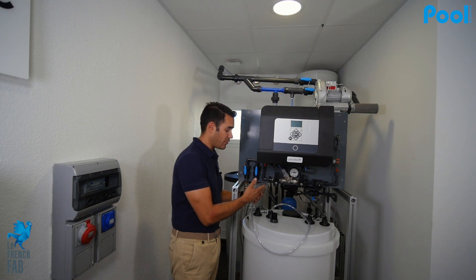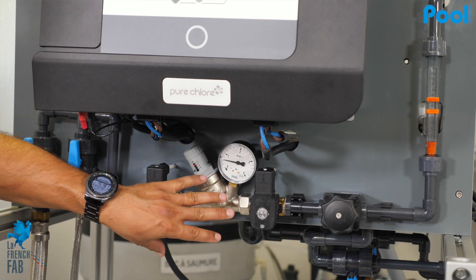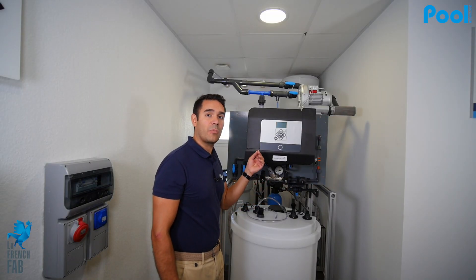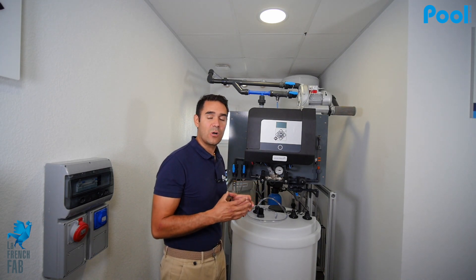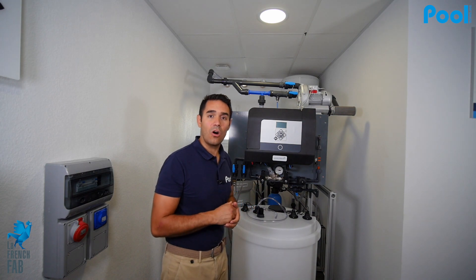The hypochlorite goes through here and you will have to connect the intake suction pipe to the dosing system through this connection. When the water arrives from the water softener, it goes through the solenoids and the water pressure control, then is mixed with the brine that is picked up from the brine tanks thanks to a pump on the back. This liquid fills the cells.